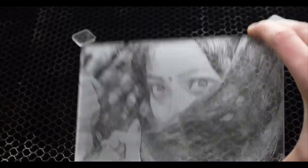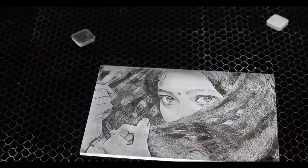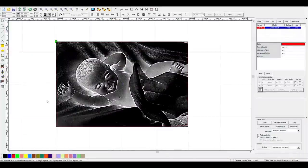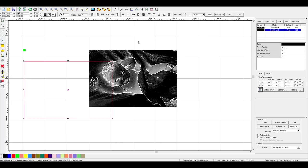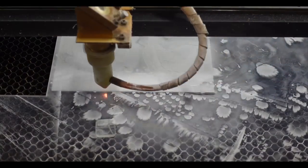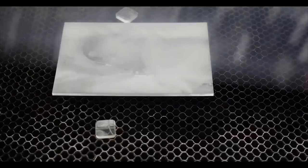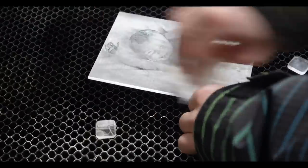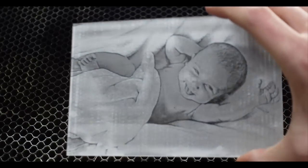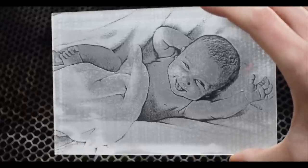That's a beautiful engraving. It pops even more if you place the acrylic on a dark background to see all the details. Now let's engrave the second image using the same settings, since these values work perfectly for my laser with acrylic. Again, we clean the acrylic with isopropanol and a tissue, then remove the back foil. Sometimes it looks kind of wet since there's still some isopropanol in the engraving — don't worry, isopropanol vaporizes since it contains pure alcohol.